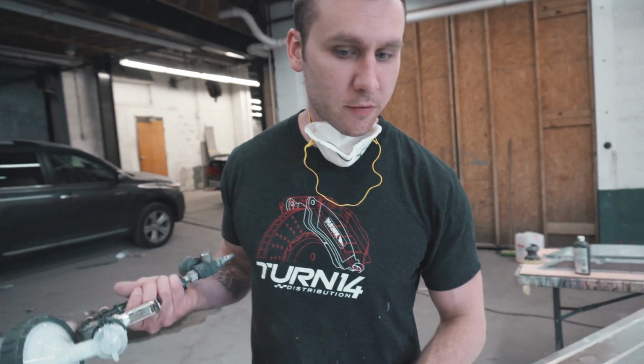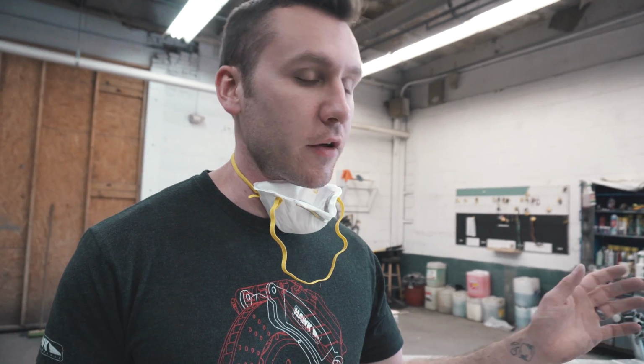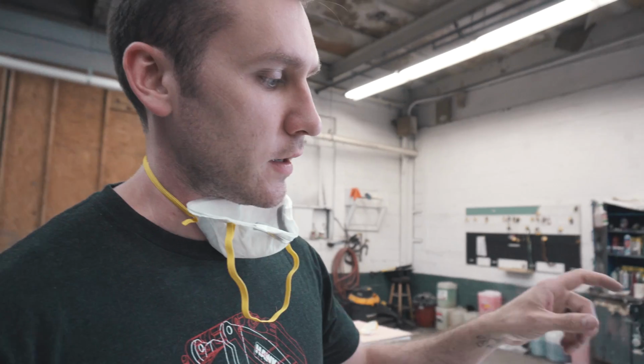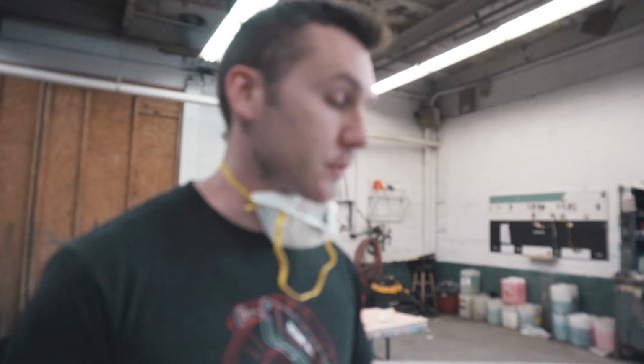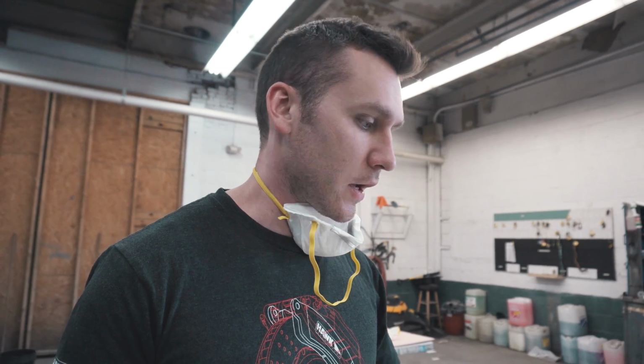So I'm just going to hit it with 3 coats of primer, because some of this is 40 grit, pretty heavy. Hit it with a coat, let it dry, hit it with a coat, let it dry, 3 times, and then we're going to conclude this part. Then the only thing I'll do after that is run some guide coat over it and smooth it out flat with maybe some 600 grit, so it's really nice and smooth. And then we have the plug done. The plug is half of the battle right there, maybe even more than half. And then next we'll get on to making the mold.